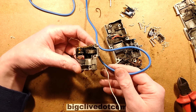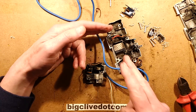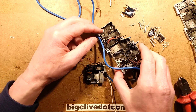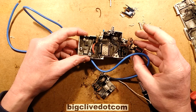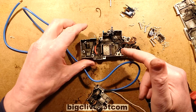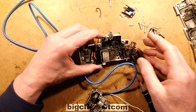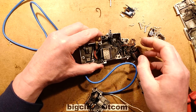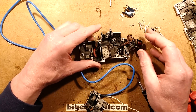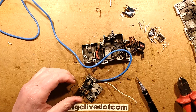There's not much left to see — it is absolutely cremated. What can happen is if you push the test button and the breaker doesn't wire correctly, the circuitry can remain powered even when the breaker has tripped. If you're pushing the button, that little resistor in there could get very hot until it fails, causing a bit of an avalanche effect — and it would then be on the input circuitry side. I'm going to explore this further.